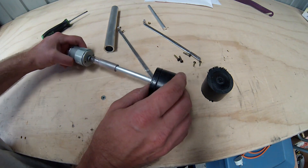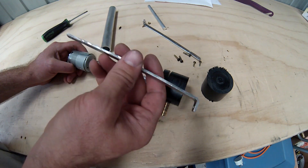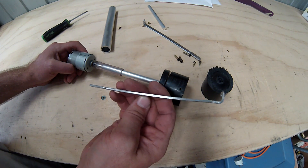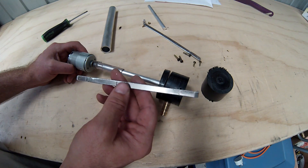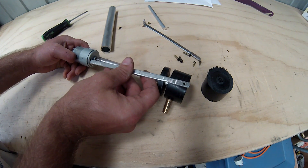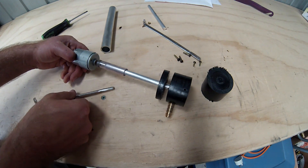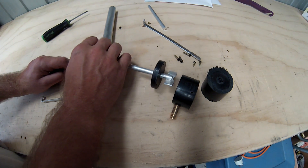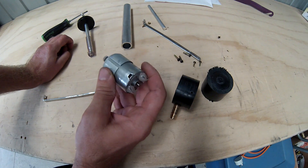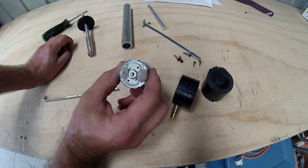To hold the pump and stop the motor from spinning and to turn the shaft, I made up these little bits of aluminium strip — cut out of a piece of 3 mm aluminium plate that I had lying around. They're pretty self-explanatory: screw them on there and screw them on the side of the pump, and that holds the whole assembly together. This 24 volt motor is something I salvaged out of an old printer, which does the job nicely.